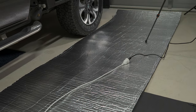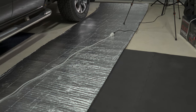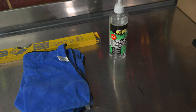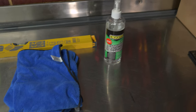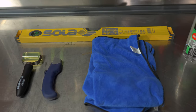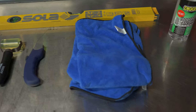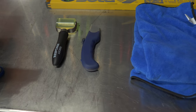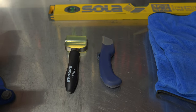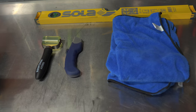I've got a 5 meter length here — so 5 square meters. You peel this side off and it's sticky back on the other side. I've got 5 meters rolled out just to try and straighten it so there's no curve as I install it. For this job I've got some isopropyl alcohol to spray on microfiber towels to clean the surface before I peel back the sticky backing. I've got a 600mm level and a 2 meter one to mark out straight lines on the insulation before I cut it. I'll cut it with a Stanley knife or even scissors. This little roller will help me apply the sticky back with firm pressure across the whole thing.